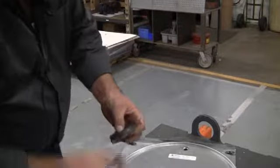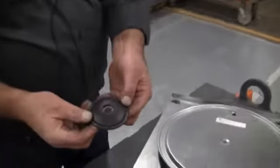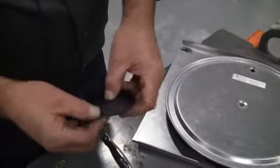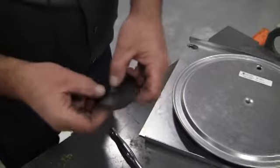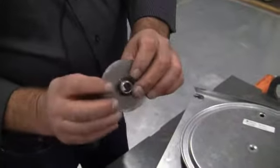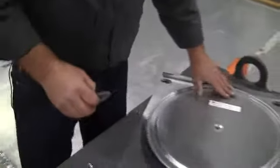The inlet seal is nothing more than a small version of an air bearing. To inspect it, you'll just want to make sure that it hasn't separated at its point of bonding to its back. It consists of a threaded inlet and an O-ring for sealing against the bearing.